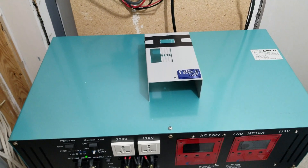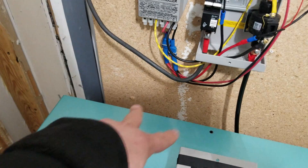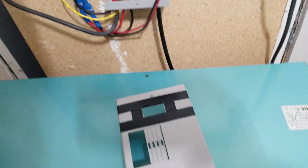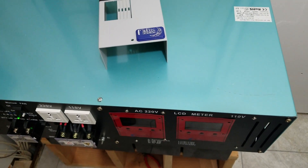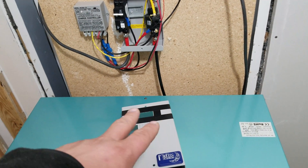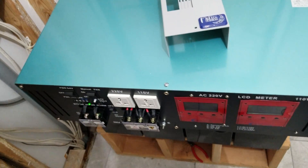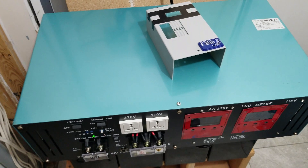So 200 CFM a piece, and the way I have it set up is two fans drawing air in and one drawing air out. With three fans running that much air, it was way too much for these little ports to push the air out — there was more intake space than exhaust space. I paid about $25 a piece for them.